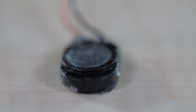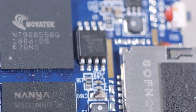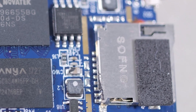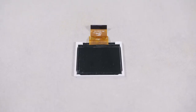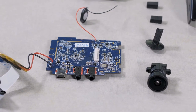The main circuit board attaches to the enclosure with three Phillips head screws, which you'd think would be enough to hold the board firmly in normal use sitting on your car's rear view mirror. But we also found five foam pads adhesively placed on the connection ports for the memory power connection, GPS, and USB. They seem to be there for cushioning purposes. The simplest theory is that they help with the positioning and cradling of the liquid crystal display, since they're on the side of the PCB next to the LCD. But they might also be there to help damp out innocuous vibrations that the G-sensor might otherwise confuse with those arising from a crash.